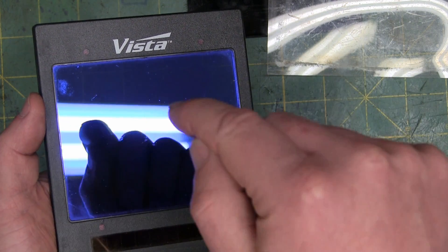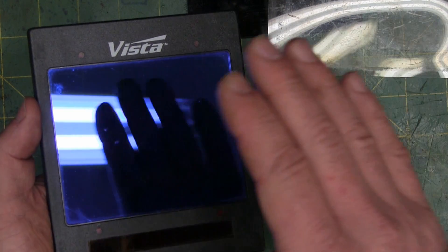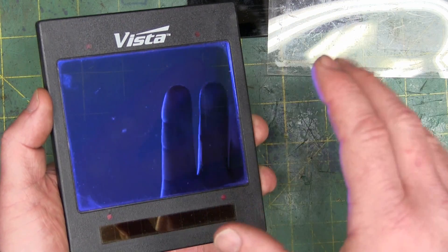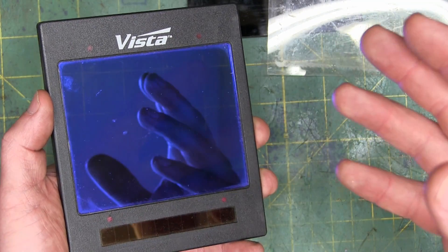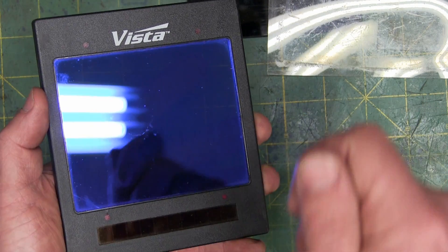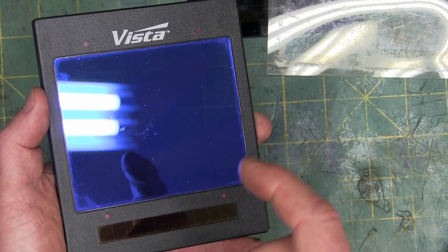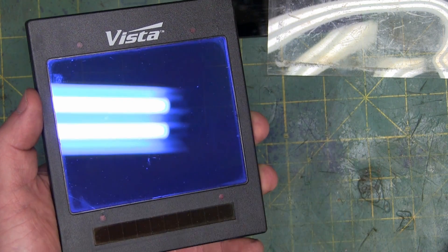And also we need to tone down the visible spectrum because it's just too bright — you can't see anything. Now, interestingly, despite this mainly being thought of as a UV shield, it's essentially an electromagnetic radiation shield. And because of that, when you strike an arc, you get lots of heat. Because of that, we can use a heat sensor in here to trigger the darkening. That heat sensor is very interesting — let me show you.